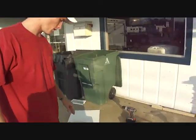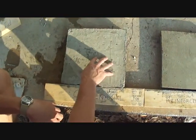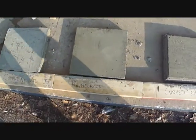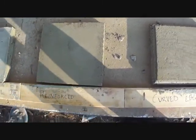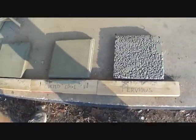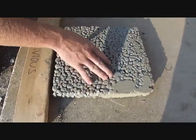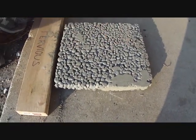We've taken all four panels out of their forms. We've got our conventional right here — nice and solid, though the finish wasn't too pretty; we could have done something on the wood. Here's our reinforced — I think this is probably our best looking panel. You can't see the rebar chairs at all where we put them in. This is our curved edge — did a pretty good job, good job Casey. And then here's our pervious — we've got a couple spots where it seems like cement kind of coupled up, but for the most part I'd say it's a pretty good pervious mix.